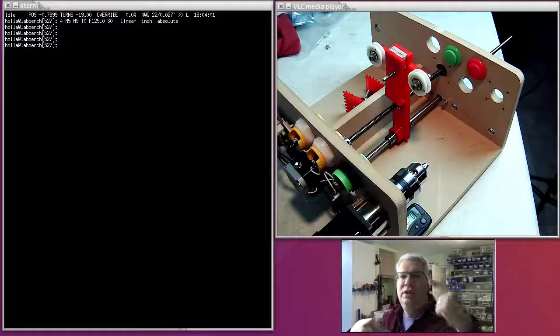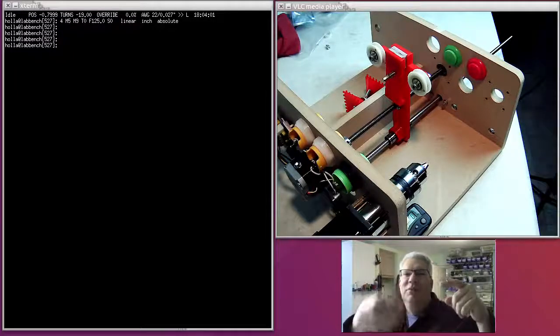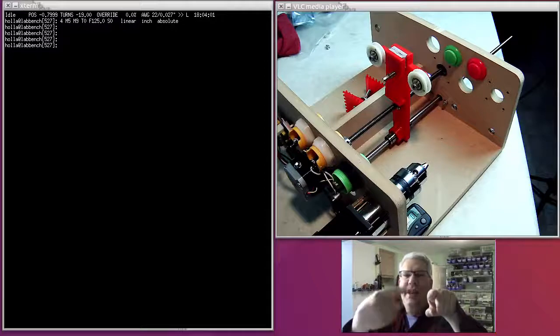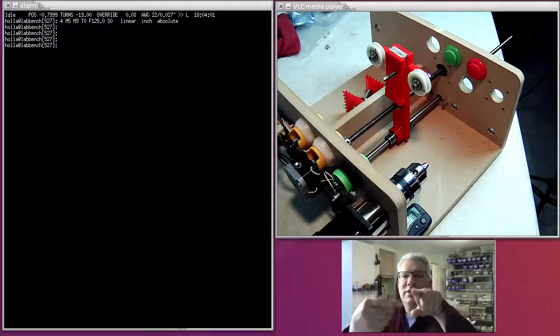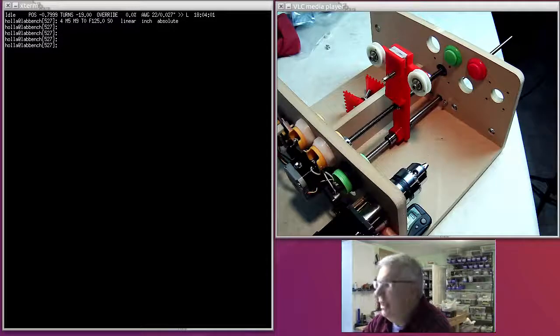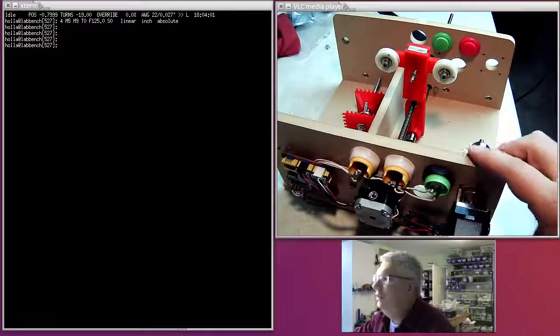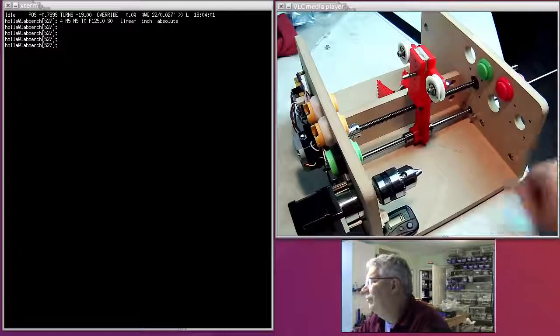It's kind of important because the reason I'm using GRBL on this machine is that I'm synchronizing the rotation while also moving the X-axis — so if the spindle is off, the whole thing is messed up and the wires won't lay down just right. I fussed with this for a while and figured out the correct GRBL setting running up to about 2,000 turns and got it right on the money. It's not quite 5.18:1 — it's something else.